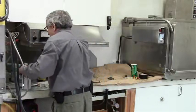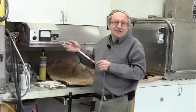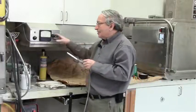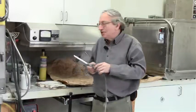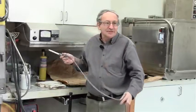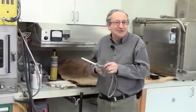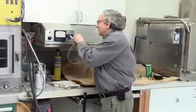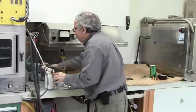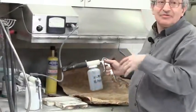Now, these systems are very, very cheap now. You can buy a system now with variable voltage for powder coating for $500 or less, and you can buy a system without variable voltage for less than $100. It's very, very cheap. A good supplier for all these things is a company called Columbia Coatings. They have a website, they have a zillion colors, courtesy of all the custom motorcycle manufacturers, so they have every color on earth. So what I do is I buy many of the cheap guns and keep each gun for one color, so you never waste time flushing out the guns.